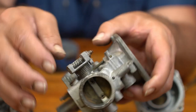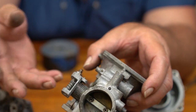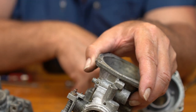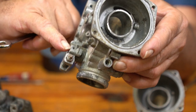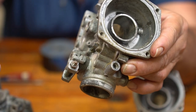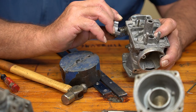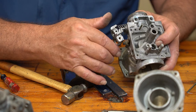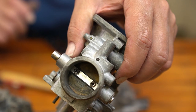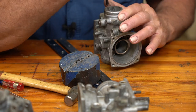I took some pictures of this right here, as far as the orientation of the springs and so on and so forth, hopefully I can get it back right. This little nut right here — a five-sixteenths will work. Also there is a roll pin right there, and that has to be driven out for this unit to come off. There's a little bit of tension on that spring. The rotation tension set on this spring is 180 degrees, so that's not very bad at all.